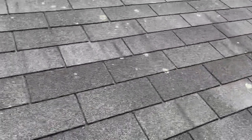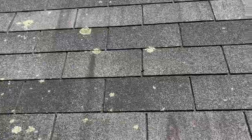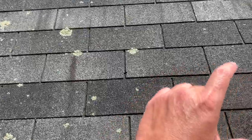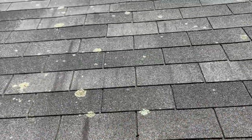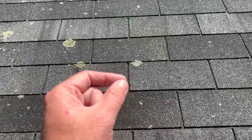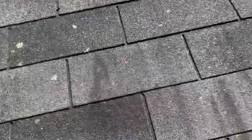But your leak is coming from that hole right there. That's a sheathing nail hole. When roofs are replaced, especially on older buildings, you should re-nail the entire roof. The roof deck — those are the boards that run across the rafters — when they get old, because of expansion and contraction, sometimes the fasteners will get loose. When they do, they will rise up, and when they rise up, they'll break through and make a hole like that. So I'm gonna go grab my caulk gun and seal that up for you.